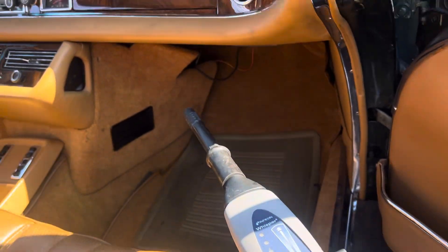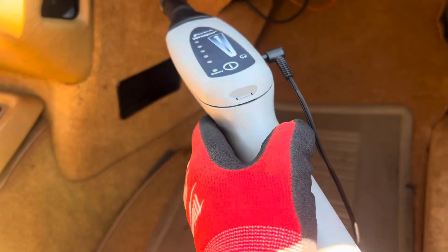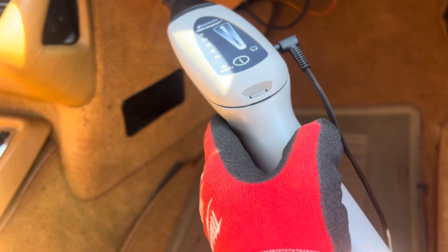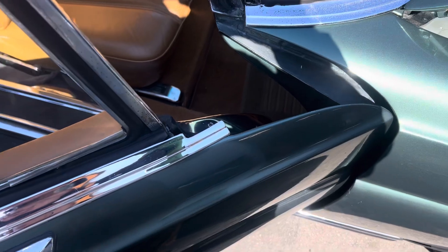Right about here — I start to feel the leak right here. When I go right here, see this panel? This panel is blocking the sound. As soon as I come above the panel, it's racing in my ears. So there's a vacuum leak down there.